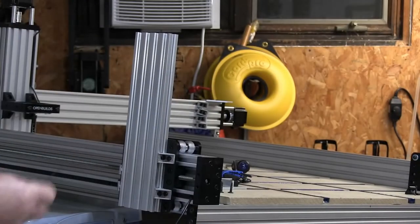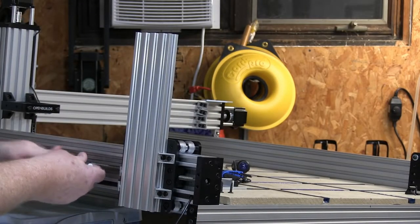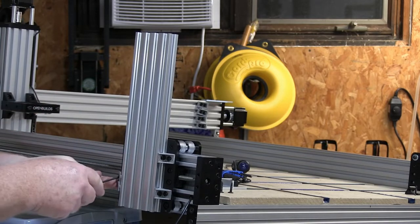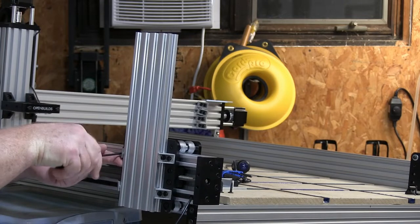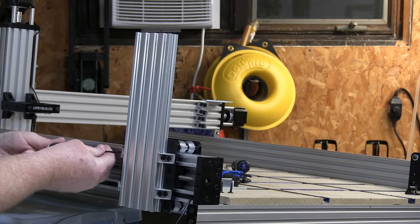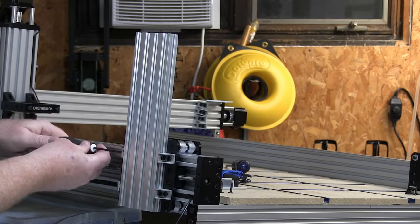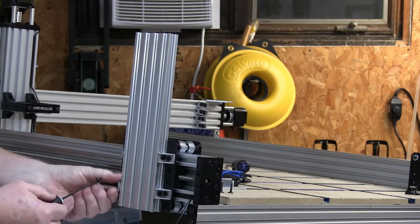Okay, gonna do the backside now. So that's why you have torque patterns when you're putting together heads or covers or things like that. And you do it in steps to give everything a chance to normalize so that everything's nice and square before you really hand the torque down to the fastener.